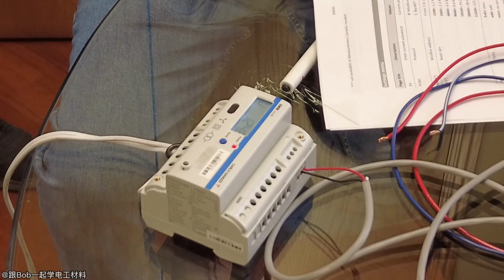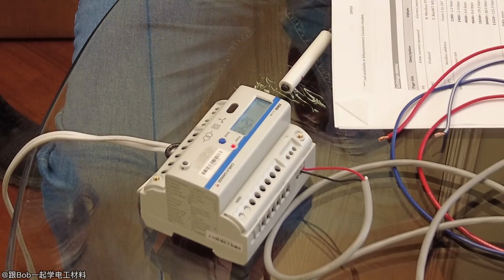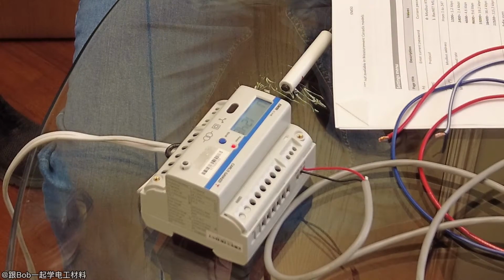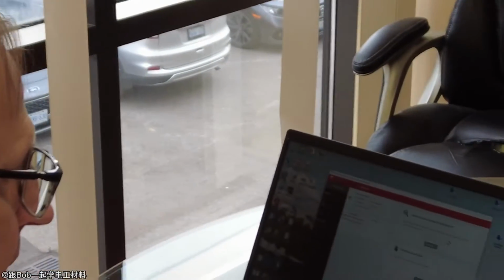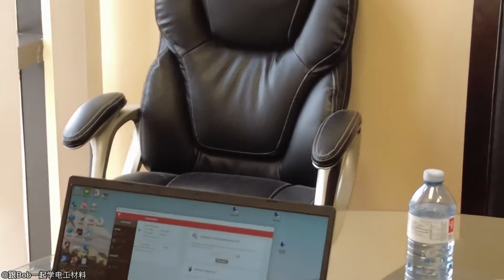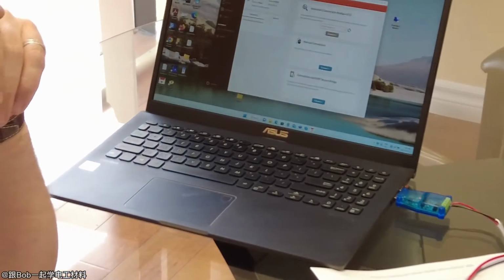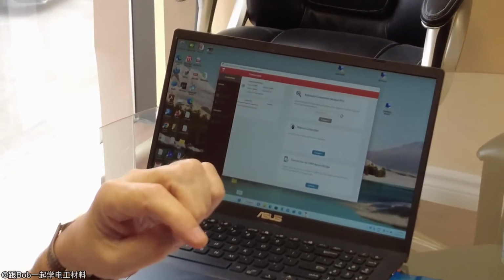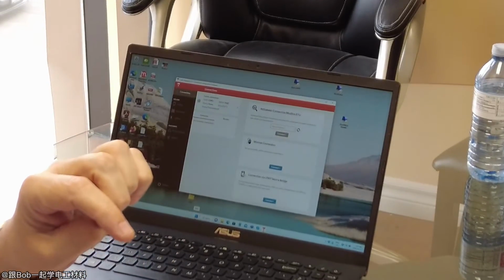Okay, so we have a software. What we call it is the UCS, Universal Configuration Software. You can grab that from our website. Sometimes you have to go and find the driver for it, but usually you can just plug it in. It'll recognize it exactly, and then it'll assign a COM port. So I think this is set for COM port 3. Do you know how to look at the device number and how to find your COM ports? Device manager. Okay, perfect.